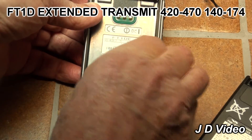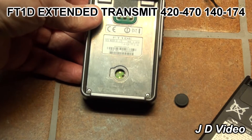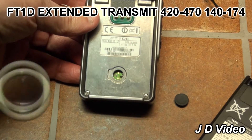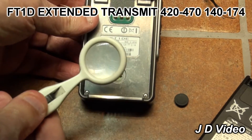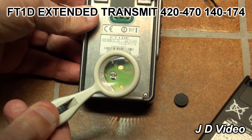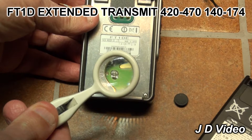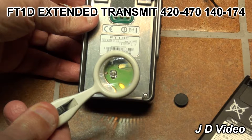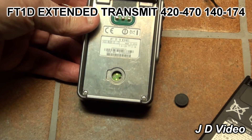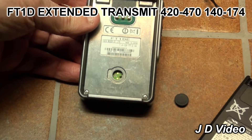This will reveal two components. We're interested in the one on the left-hand side, which is a zero-ohm link and is labeled '00'. This link needs to be removed — be careful not to get any solder bits dropped down inside the case.